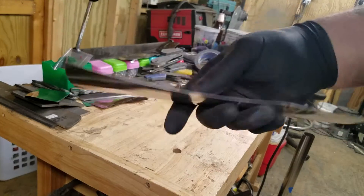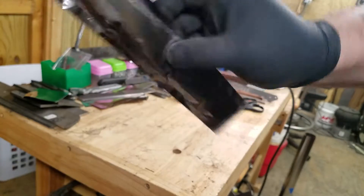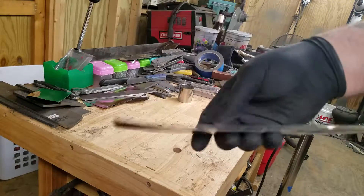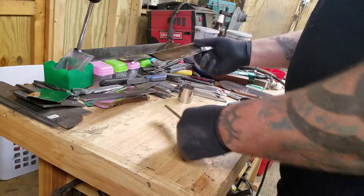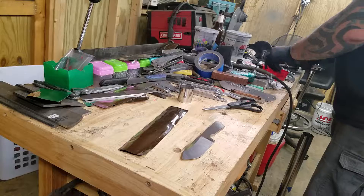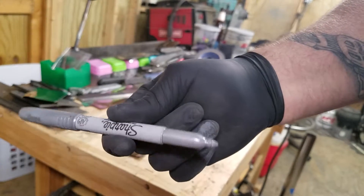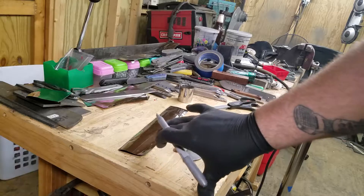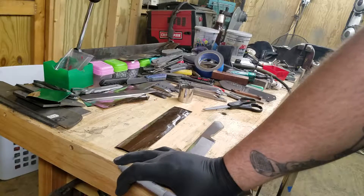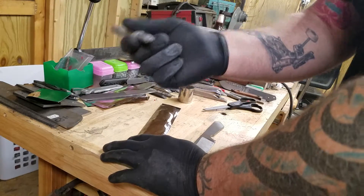And there you go — we've got a packet. I've still got to drill the holes for the handles on this knife, but as soon as I get those holes drilled, all we've got to do is bend over the end of the packet and she's ready to go. We'll mark it with a metallic Sharpie. I found out the other day that metallic Sharpies will survive the furnace. The last BG-42 blank I made, I had information on the outside as to where the spine was and where the tip was, so when I pulled it out of the furnace I could cut it out of the foil as fast as possible. Metallic Sharpie will survive the furnace.